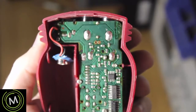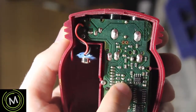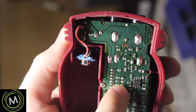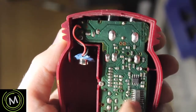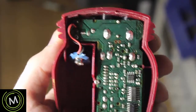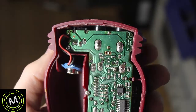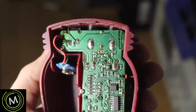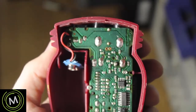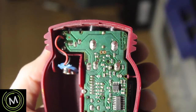Just hot off the rubber, I can see there's a soldering issue on this zero ohm resistor — there's something under there that looks like a solder bridge, and it doesn't seem like it's soldered all the way. I'm going to fix that. Other than that, there's not much I can see causing a problem, so I'll take these screws out and look underneath as well.